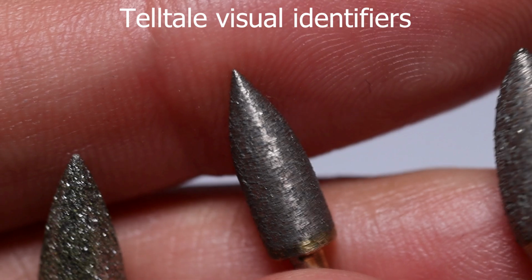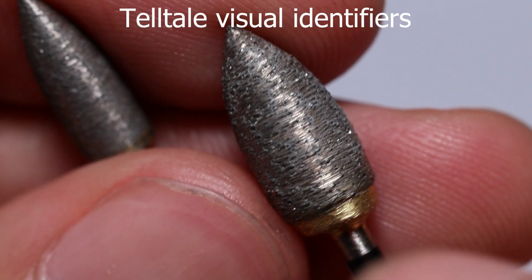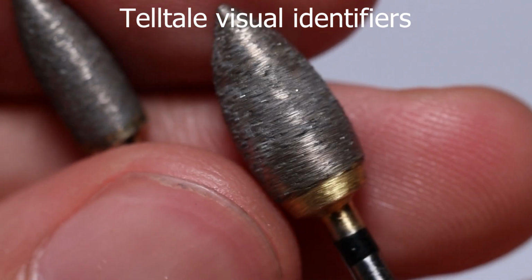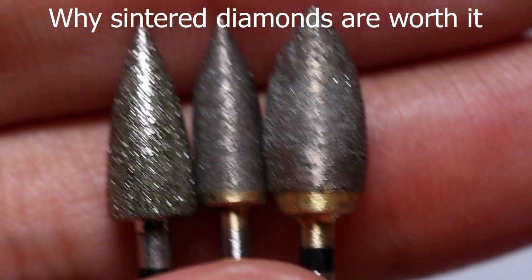They can dislodge. Doesn't happen so much with the finer 600 style grits, but with something like the 80, the diamonds are pretty chunky. You can see them with your eyeballs. So those ones can get ripped out. But that difference in lifespan is where the money is.